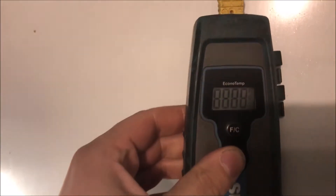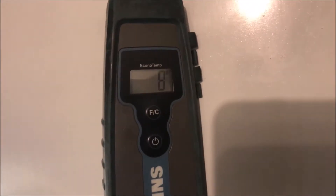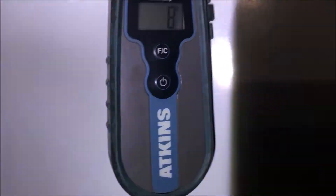As we can see here, it's showing about 3 degrees. Let me put my meter in here — it's reading 8 degrees, so that thermometer is not reading 100% accurately. Let's go based on our air probe.